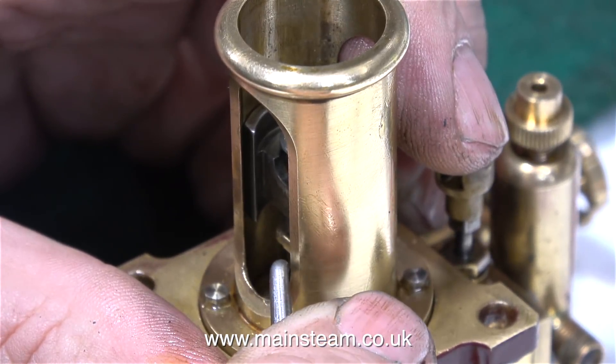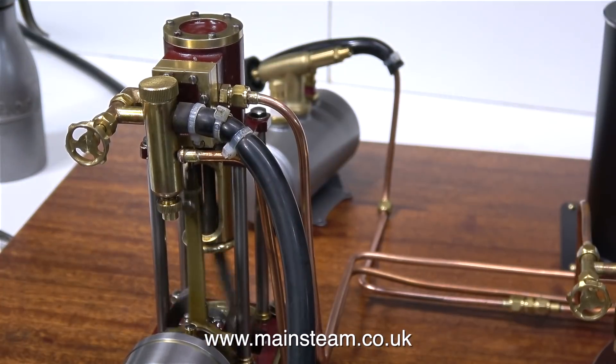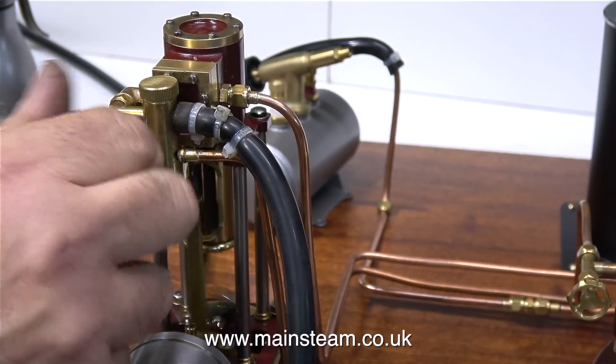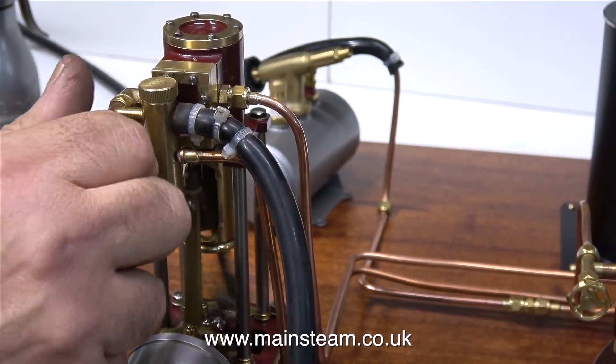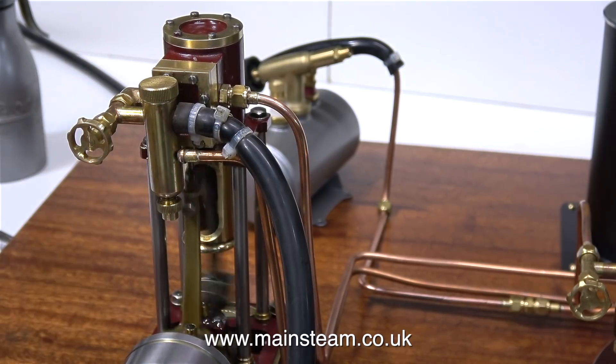The engine is running. It sounds a little bit like a machine gun crossed with a pneumatic drill, but it's running. The engine feels slightly tight because suddenly now it does have a piston ring. The main reason why this engine is making such a horrible noise is that the air has been admitted to the cylinder very late.